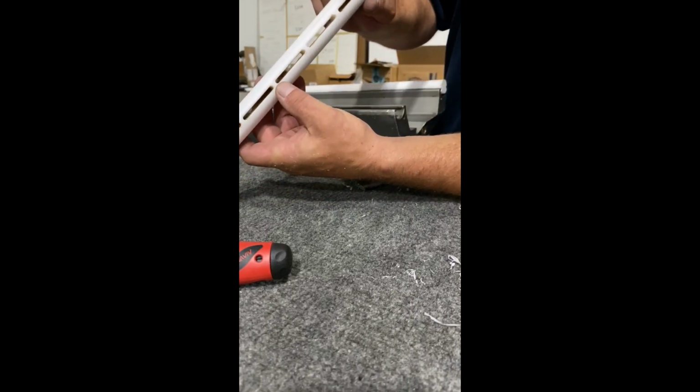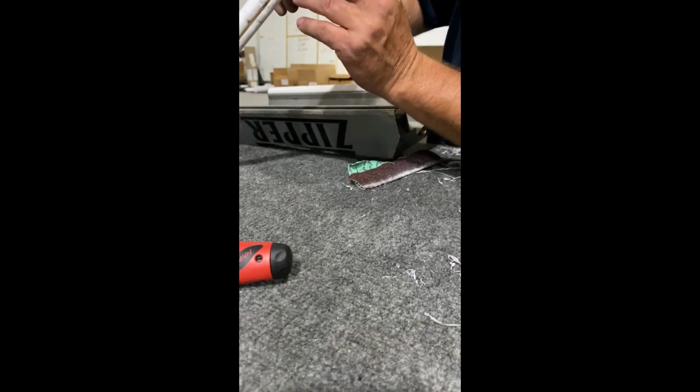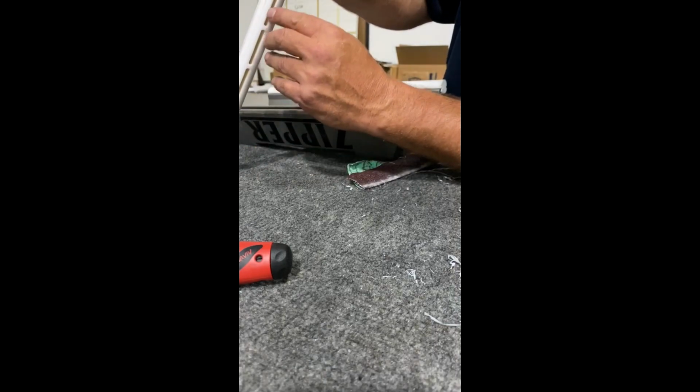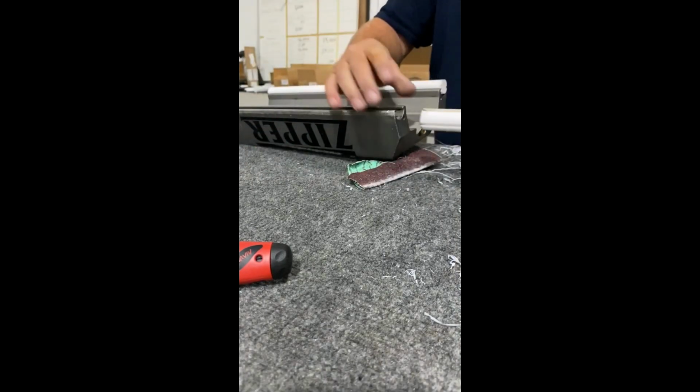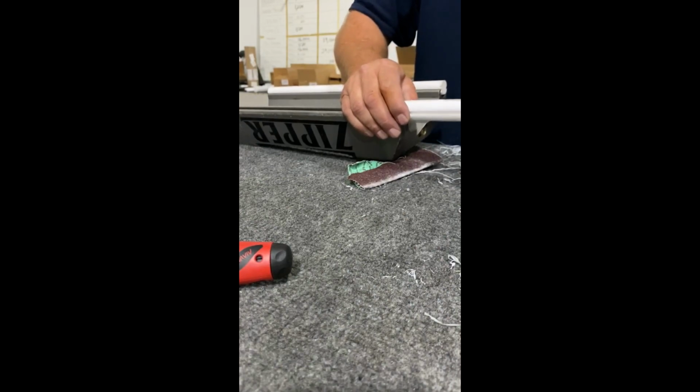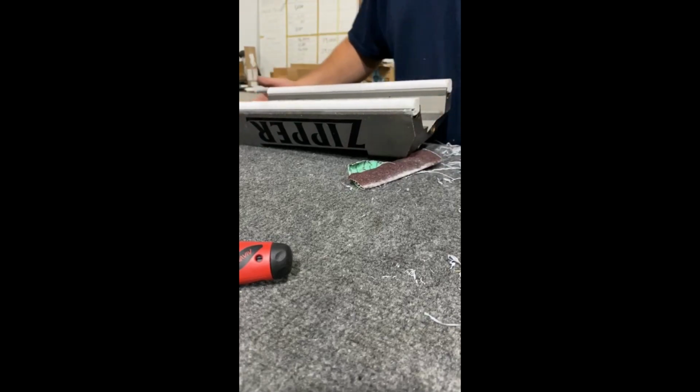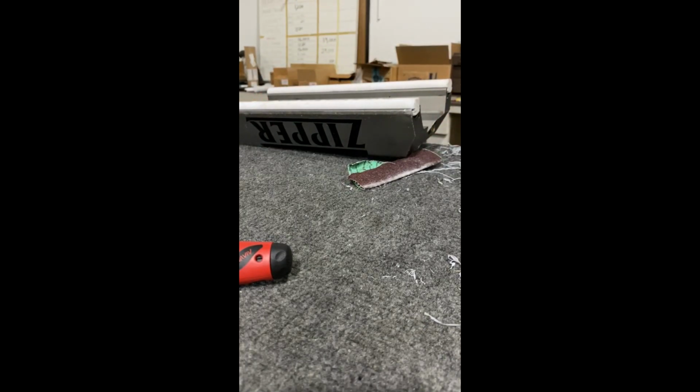Now, he has the recessed bridges. He wore down the side and chipped it all up with the side that was recessed. I could take a Dremel and recess these, but by the way this was plugged up, I think he'll be better off with this because the hair will rub off. So I'm just going to simply flip his glide and put this thing back together. Simple as that. We were missing a glide retainer, and the one that was on there was pretty beat up. So I'm going to get him a new set of glide retainers.